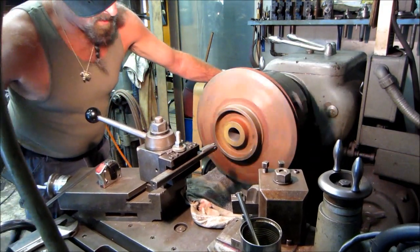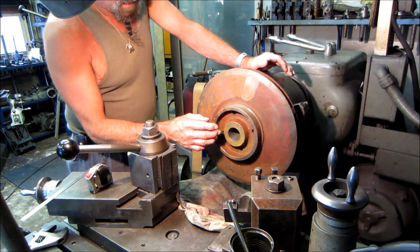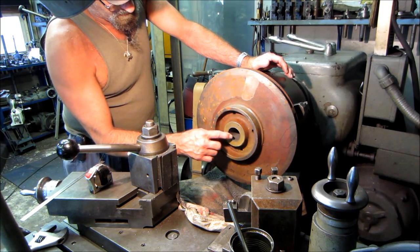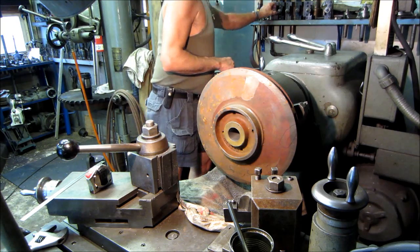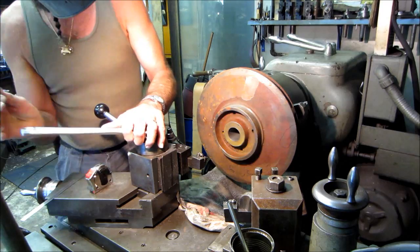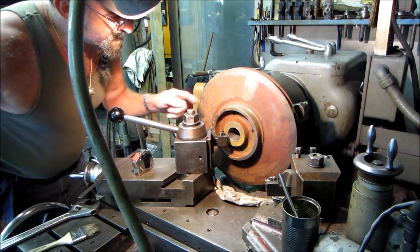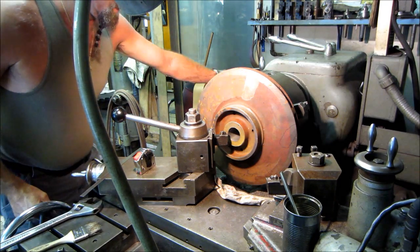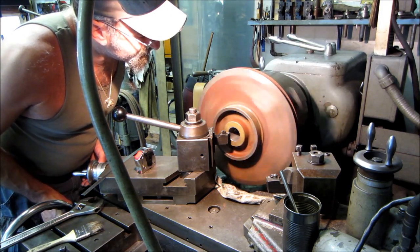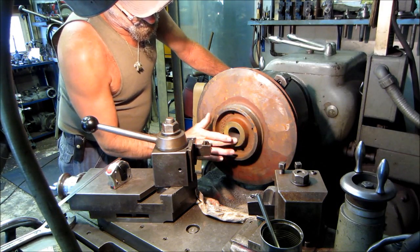All right, there's our finished bore. We're going to go in the other room and start setting up. In fact, I think I'm going to kiss this a little bit on the side here, just because this gets that little protrusion of about a hundred thousandths sticking out on the back side here. I really want to make sure that I got a good bond there.